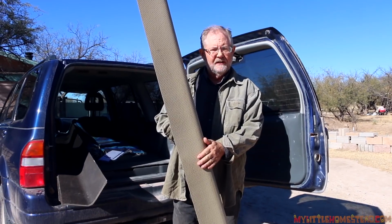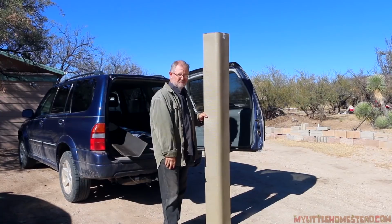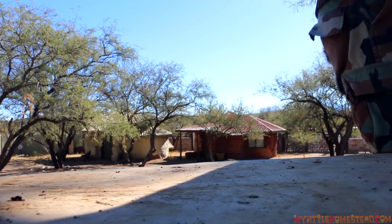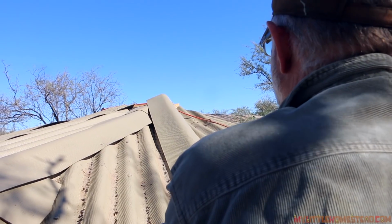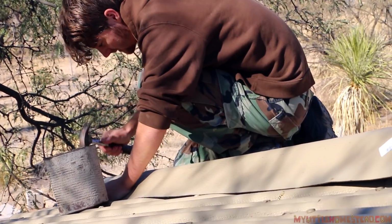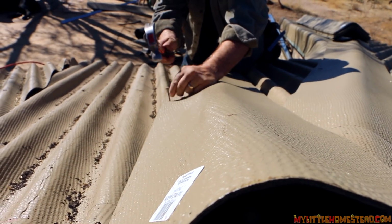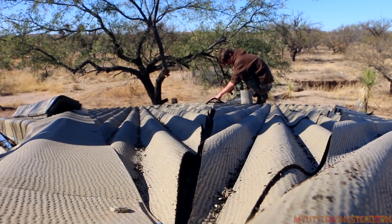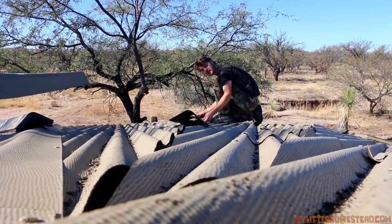Hard to find stuff. I'm hoping to finish with the materials that we purchased today. It's hard to get, and we bought them all out of the store. So it works out pretty good. These land right on those ridges and covers up that spot there, and all the water runs down just correctly. The thing about this material here, especially this ridge cap, is that they have the 6 foot pieces like you see here, but they're going to 3 foot, 2.5 foot pieces, shorter pieces that you have to put a lot on, which means a lot more joints that have to be done.